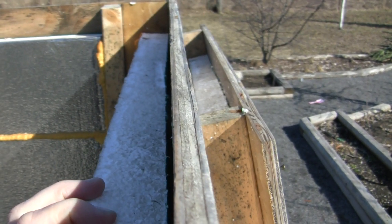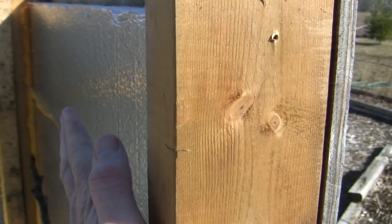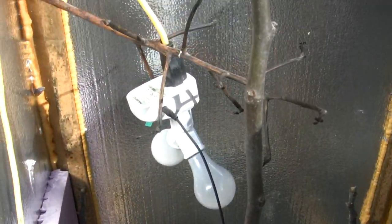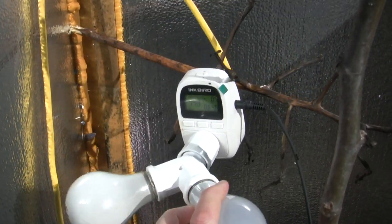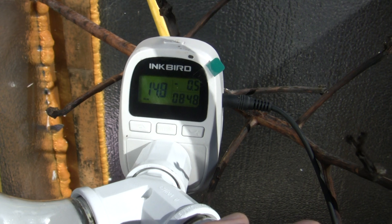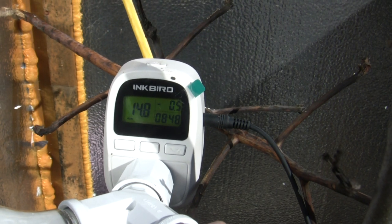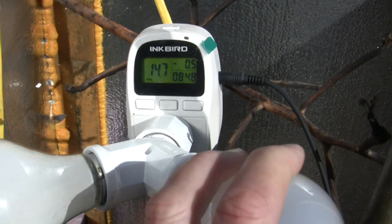I'll probably stick with the pink stuff, and maybe go thicker — this is about an inch and a half or two inches. The way I built this box, with the two-by-fours going this way, you could have a thicker insulation to make it flush, which would save a bit of energy. I'm heating this with two light bulbs — I believe they're 100-watt — just plugged into a device I got on Amazon. It's set to minus five or minus two to come on, and turns off at minus 0.5°C, so it keeps it just below freezing.